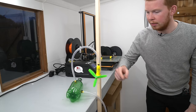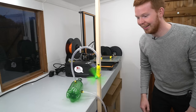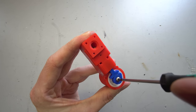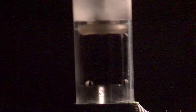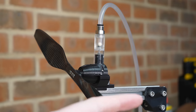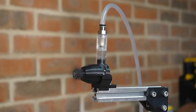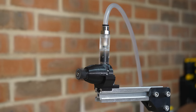Fortunately, I've been developing 3D printed air engines for a while now, and have tried many different designs such as spring operated inlet valves, common pushrod valves, diaphragm actuated pistons, and the latest design that uses a custom moulded piston seal that expands under pressure to make the piston airtight, which is very similar to the Air Hogs engine. And this engine has been a huge step up in performance compared to my older designs, producing 350g of thrust from an engine that only weighs 40g.